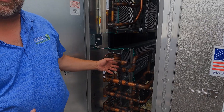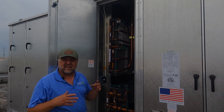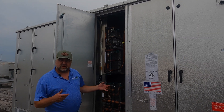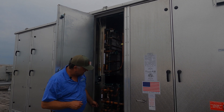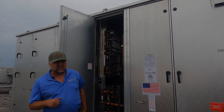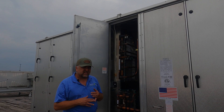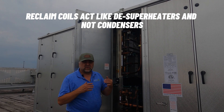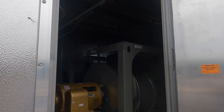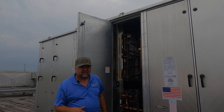This will not change state. All it does is act kind of like a de-superheater — it takes all that extra heat, removes as much as it can, and then sends that gas, which is still in a vapor state, back to the condenser where it will change state. A reclaim coil does not take it from vapor to liquid; it's just de-superheating that hot gas, removing it, and dumping it back into the store as basically free heat. Pretty cool, right.